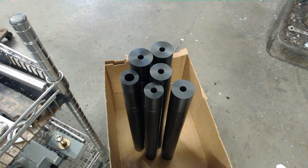And here's the finished shot of all six joints, ready for the next step. You may notice that these joints are different lengths. When finished, all six joints will be 566 millimeters long. But I've decided to leave five of the six joints long at this point. This way, if the conical bore doesn't end up being positioned absolutely perfectly, I can fix it.